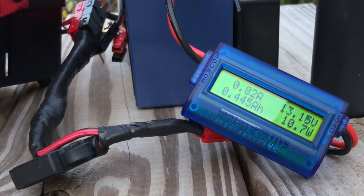The cumulative readout shows what you've drawn out of the battery over time, which is really helpful for keeping up with how much power is left. As it cycles through, you can see I've used just under half an amp hour so far. If you're operating portable with a 10 amp hour battery, and you know lithium iron phosphate can discharge to about 90%, once you've consumed nine amp hours on the meter, you know the battery is pretty much dead. Back during field day at lower power settings, I was able to get 9.3 amp hours out of this particular battery.